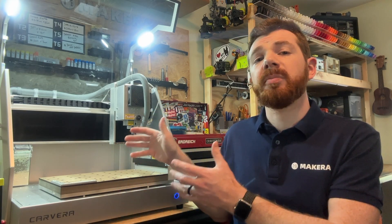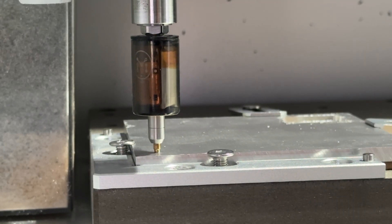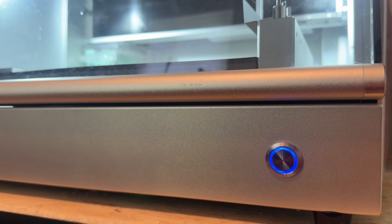Whenever you start a manufacturing project, we always want to monitor the machine closely during the initial calibration stages, as this is typically where something might go amiss. Watch the scan margin steps, ensure that the probe touches the stock to measure the height correctly and that it does not collide with any clamps, and if something doesn't look right, stop the machine and adjust as needed.